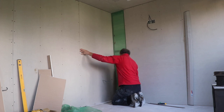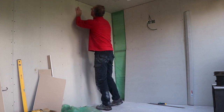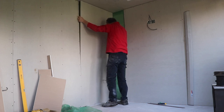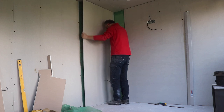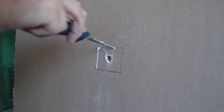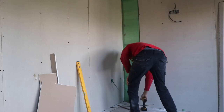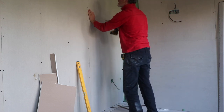You may wonder what all that knocking and banging was about. Basically I've got the plasterboard in position but behind it is a wall socket — the electrical back box protrudes maybe a millimetre or two out from the line of the wall. What I'm doing is making a mark on the back of the plasterboard so I can accurately cut out the position of the electric back box. Having repositioned the board on the wall it's then a case of getting it secured with the drywall screws.